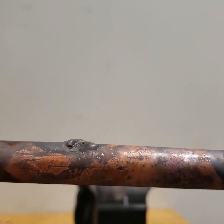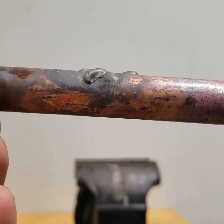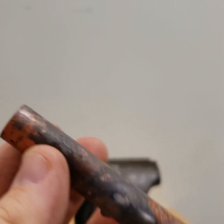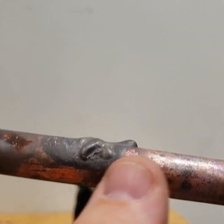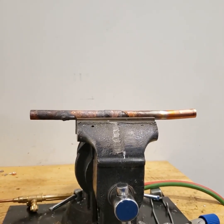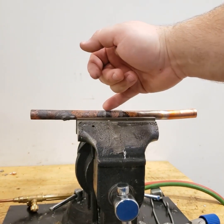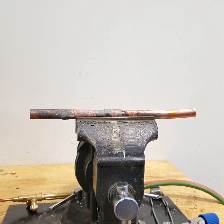Here is the side of the pipe where I had a hole and fixed it. I don't know that I would ever try to fix a hole like that as a permanent fix in the field, but if you were in an emergency and needed to get something going, that may be one way. I've had older copper that has started to crack, and I've laid braze — layers of braze — over the outside of it to hold it and try to get by for a period of time.